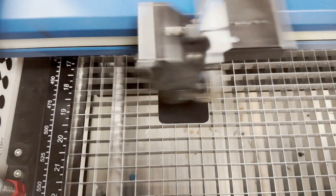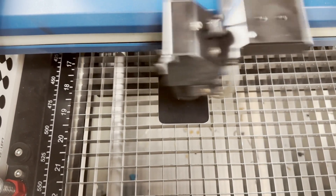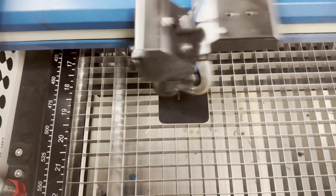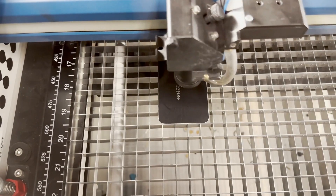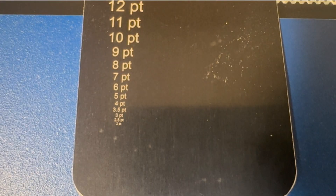Let's go see the results. Here in the laser, we've got that same piece of anodized aluminum and we'll go ahead and start the engraving. You can see this is at 100% speed — you can really see the speed you can get with the Epilog on that material. You can see just how nice and crisp the engraving is, and we've got all the way down to two-point font and that is still readable. We're running this at 1,200 DPI, so if you're going to do a really small font — 3.5 point or finer — you're probably going to want to use that higher resolution. But if you're using 6, 7, or 8 point font, 300 DPI should be just fine.